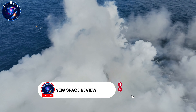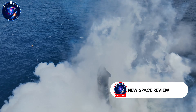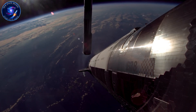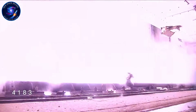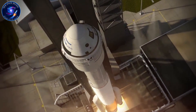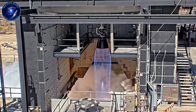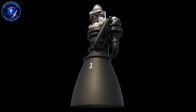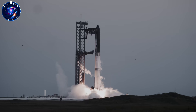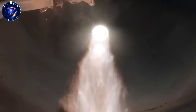Then came the industry's revealing reaction. Tori Bruno, CEO of United Launch Alliance, looked at photos of Raptor 3 and publicly stated it was a partially assembled engine without controllers, fluid management, or TVC systems. ULA builds the Vulcan rocket and launches major U.S. military payloads — a joint venture between Boeing and Lockheed Martin. Their CEO looked at SpaceX's finished engine and genuinely believed it wasn't complete. That's how radical Raptor 3's design really is. Gwynne Shotwell's response was perfect: 'Works pretty good for a partially assembled engine,' showing Raptor 3 firing with all systems integrated within that clean exterior. The ice visible during testing is condensation from cryogenic methane flowing through internal channels, proving the cooling works effectively.